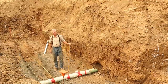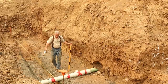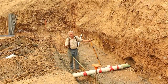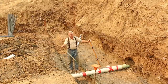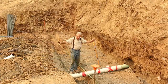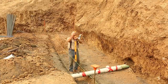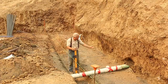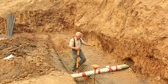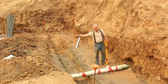This footing is eccentrically loaded — another way to say a cantilevered footing. The wall is going to occur about six inches back from the edge. I'm putting about a two-inch buffer between the property line — this string is the property line, and this string is where the form is going to occur, so there's no danger of encroaching on the neighbor's property. An eccentrically loaded footing has the vertical bearing issue right here on the edge, and all that weight in the footing is dealing with the weight of the backfill bearing down and resisting the overturning moment on the wall.